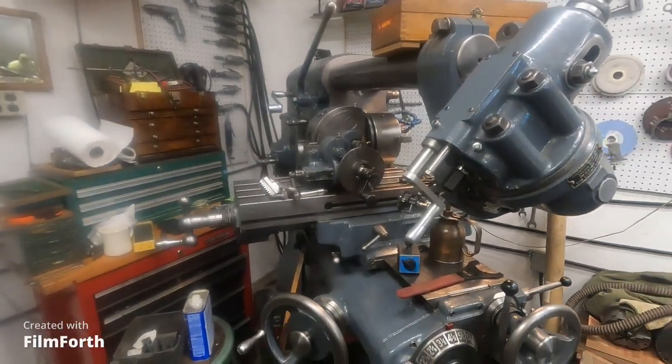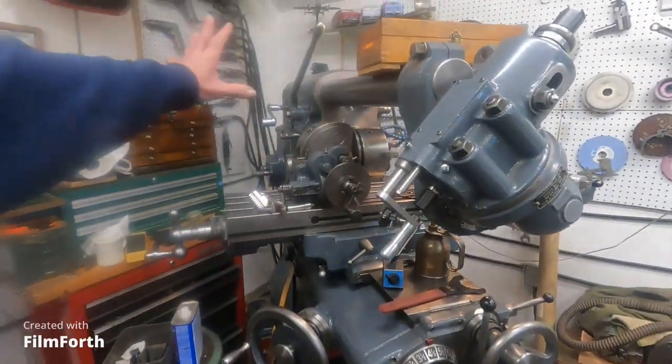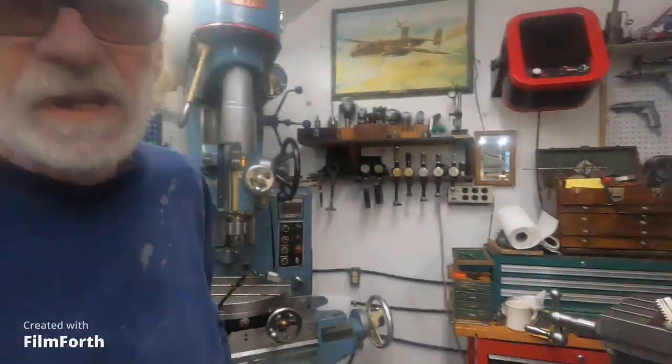What I'm doing here is moving these machines. This machine here is extremely heavy — it's called a heavy mill, a number two that weighs 5,000 pounds. It's got that really wide base and extra long over arms. I had it over here on a soft spot on the floor and it was sinking, sinking, sinking. I was sticking chunks of metal under it. I got a little drill press on that soft spot, and the corners here are good and stable, so I'm leveling out the machines now.